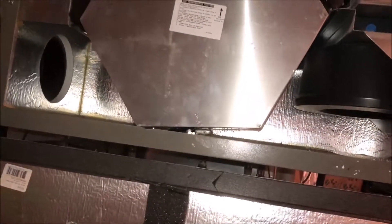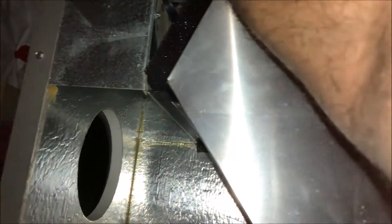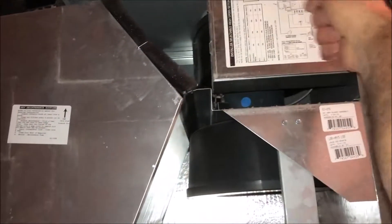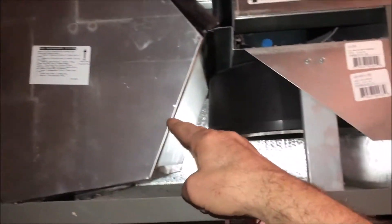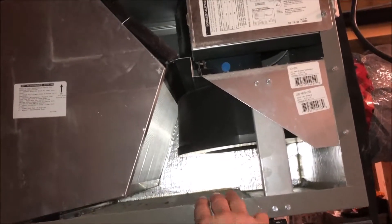With the clips on top we open up the door and the fans will stop. You can feel the cold air coming in here, blowing through here. At the same time you've got warm air coming from the house blowing through here, and in this box the heat exchange happens, warming up the cold air coming through and saving energy while keeping the house warm.